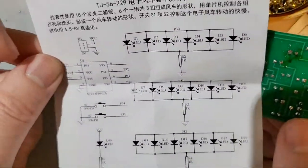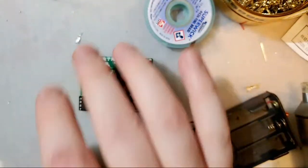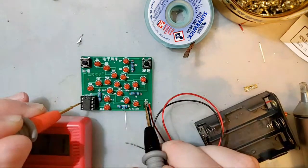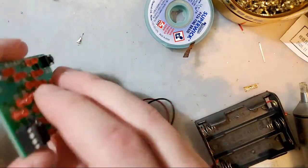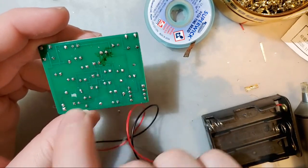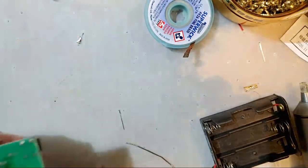We can look at it from here. It should be the same layout, so it should be the second pin. We can actually verify that with the multimeter. Pin 2, VCC, beep, boom. So what we can do is I can connect a wire from this pin right here to the LED right there and just bypass this whole trace. But we're going to go the easy way.